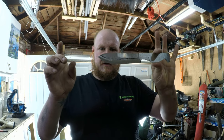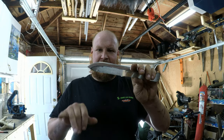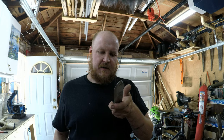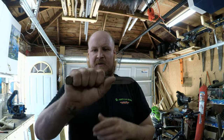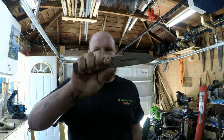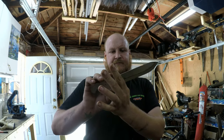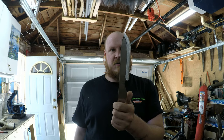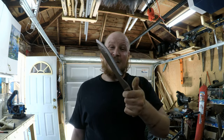Got my roughed out bevel in there. I didn't make it sharp yet because I want to heat treat it first, and then you get your final sharpening in there. I'll be cleaning up this bevel a lot nicer. I'm pretty happy with that — it fits really nice in the hand. Even if you want to pommel something, this won't slip back, this won't slip forward, your finger sits nicely in there. Especially once you put the wood handle on, it'll sit really nice in her hand. So we're going to get on to the heat treating. I'm going to be doing this at work, so I'll be bringing you guys along and I'll do this over lunch break, and we'll get a nice heat treat put on this.